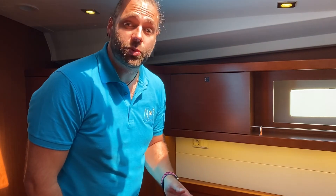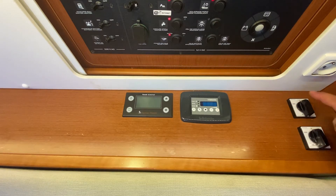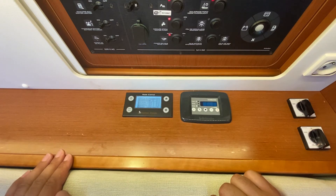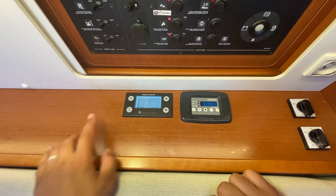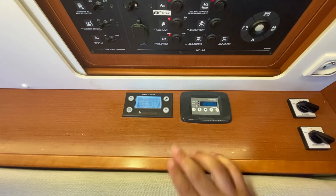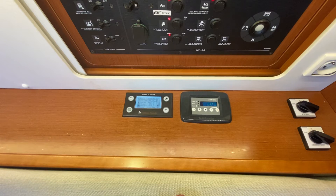Remember, if you have a problem with the air conditioning, double check the main switch to see whether it is connected to shore power or the generator. To run the air conditioning off the generator, first switch AC power and air conditioner to off. To start the generator, hold power on the Panda eye control. When it is on standby, press start — it will go through preheat and then start automatically. It will first display 'override,' then after a few moments switch to 'running.' When you see 'running' on the panel and 'OK' on the levels, switch the controls to generator. The air conditioning will start and power returns to your AC 230 volt panel. You can now turn on the air conditioning.